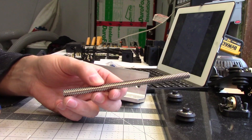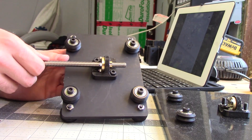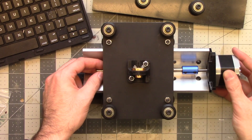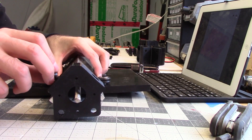Today is tomorrow — I've got the parts that I need and a hot cup of coffee. Let's continue. So this is the piece I was missing yesterday. The idea here is that we need to adapt the shaft of the stepper motor that's actually going to drive the axis to this threaded rod that the axis rides on.